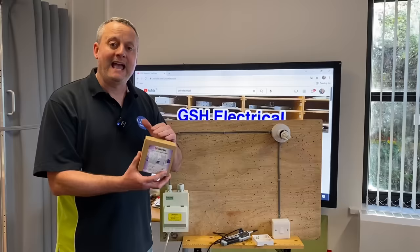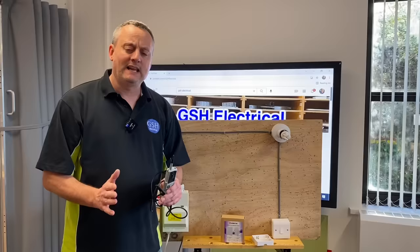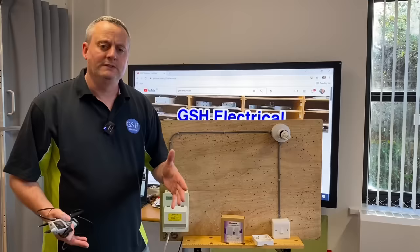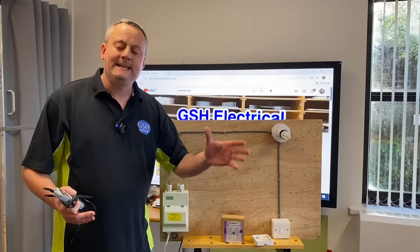You can then pair up to five additional switches that have no cables and no batteries — they work on kinetic energy. However, before we change that switch out, in the real world you're going to need your voltage indicators, proven units, locking-off devices, signs, etc. I've covered the safe isolation procedure many times on the channel, so let's make sure we're working safely. I'm going to disconnect mine and move it to a central position so I can show you the connections in this inline receiver.